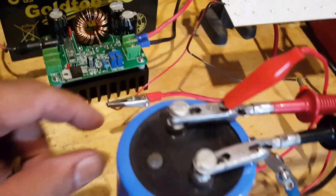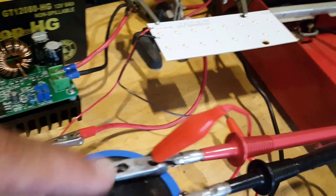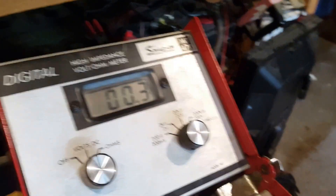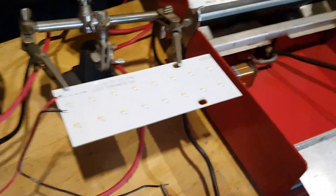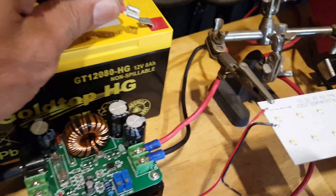Okay, what I did — I put this LED strip in series with the positive side of the capacitor. And these are the voltmeter leads, showing 0.3 volts, which is just the residual charge in the capacitor. The negative from the buck converter comes to the negative side of the capacitor, and the positive goes through the LED to the capacitor.